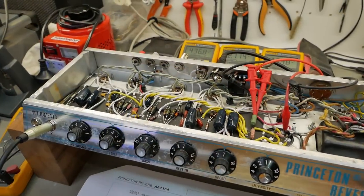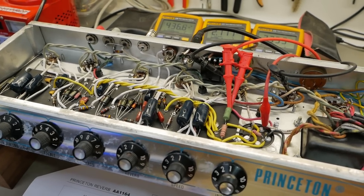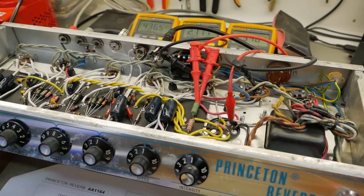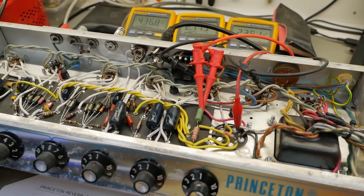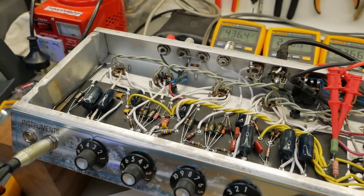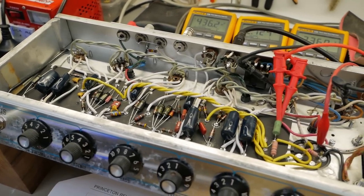All right, so next thing, I was chasing some kind of paper-teary sort of distortion-y sounds, and couldn't really find any definitive cause for it, but then I thought, let's just try the test speaker instead of the speaker in the cabinet, the Fat Jimmy. And all problems cleared. So that Fat Jimmy sounds terrible for this amplifier. It's a real fizzy sort of paper-teary distortion. So I'll just show you right now the difference between the two.